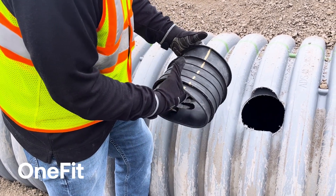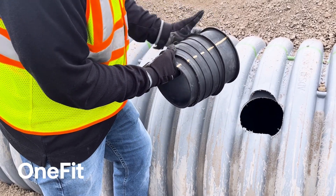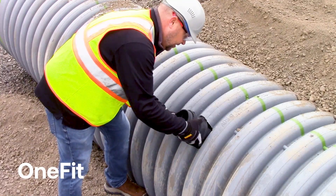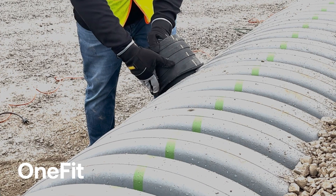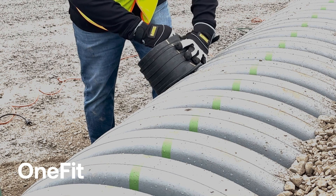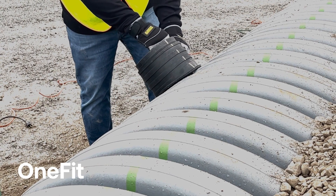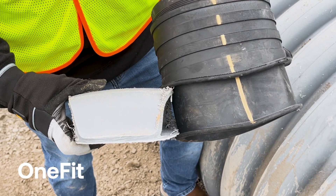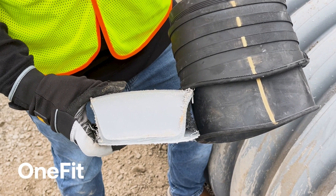Be sure the gold lines match up. Next, fold and place the rubber sleeve into the cored hole. For one-fit, the inner sleeve should seat snug to the inside of the host pipe, and the outer sleeve should be adjusted down to the host pipe's outer wall. This will sandwich both sides of the host pipe, creating the look and feel of the traditional fitting.